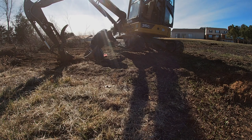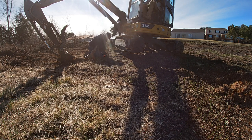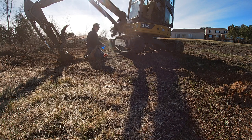I've got Cory up in the cab and he is working the controls. It really works best when you have two people doing this. The first thing I'm doing is loosening the grease fitting, and you're gonna see here in just a second - watching the bottom track, it's loosening up now. You'll see that piston is compressing, and look at all the slop coming in the bottom track. That's exactly what it's supposed to do.